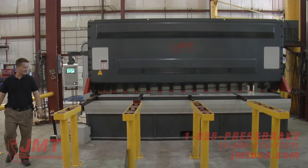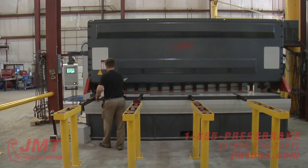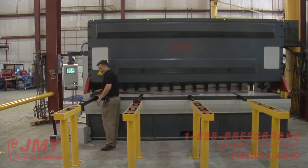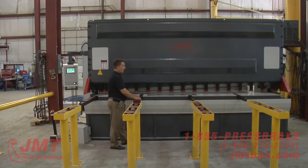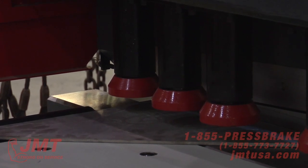I'm going to go ahead and grab a piece of stainless — this is just quarter inch stainless. I've got a standard squaring arm with recess scale, front part gauging, and ball transfers built into the table. It's all just standard features. You can get optional longer arms; this particular customer decided to build their own front extensions, which is fine — they did a nice job. I've got a light curtain on this machine. Let me go ahead and shear it.